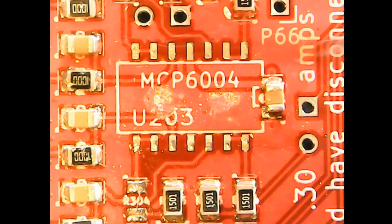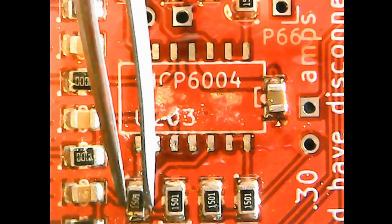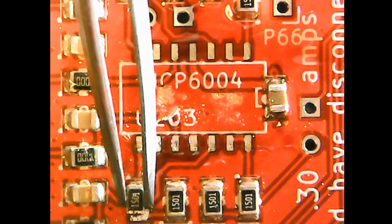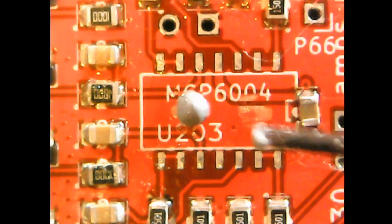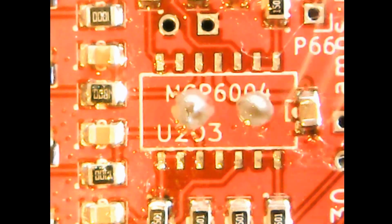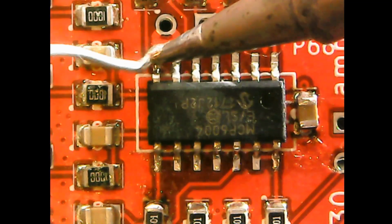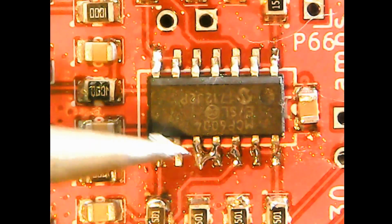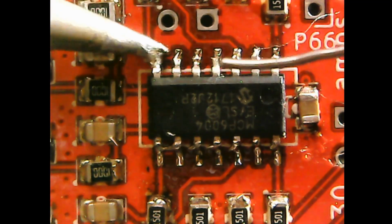Repair parts that got accidentally dislodged. I went with thermal glue and made sure it was far away from the pads. A quick test fit and checking the underside of the IC that the glue is touching it, and refit. Tack the corners, then resolder the pins. What looked like a slight nudge to the left to fix ended up taking half an hour.